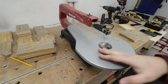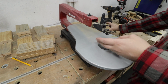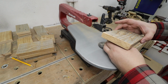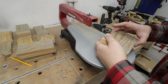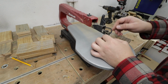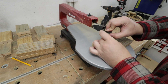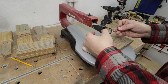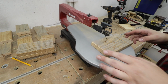It's a scroll saw, okay, more or less it works on the same principle as the handheld fret saw. It's just powered by a motor. So we've got our blade just over here. Whack it through the hole that we made with the drill bit, just like so. Now we need to attach the blade. Check the tension, and off we go.